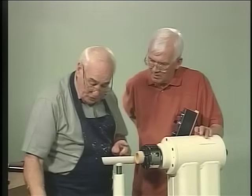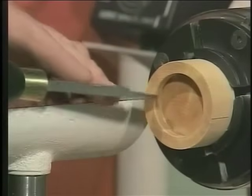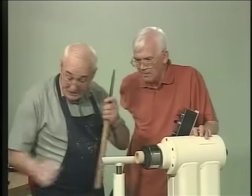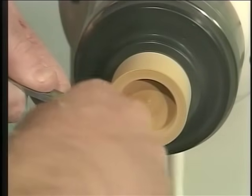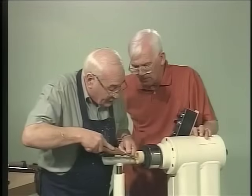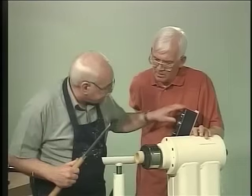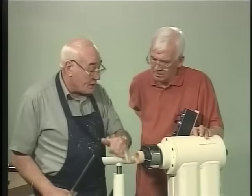And if we don't round this edge over, as we go out with that's the front edge. Front edge here. Yeah. And what you'll see is if we don't round that over, as the chaser went in, the sharp tooth would catch on that edge, and it would just stop the tool progressing forward. Right. So I'll use the armrest and the point tool now, and I'll just roll round that to just round the edge over to give the tool a nice gentle soft start. I'm just coming round the face to clean up the face as well. That's it. Now, we're completed, ready for chasing.